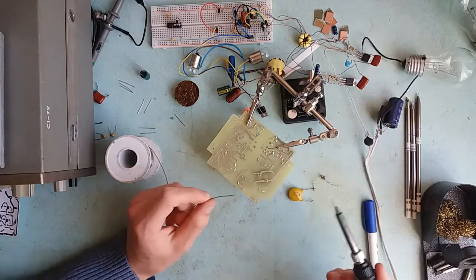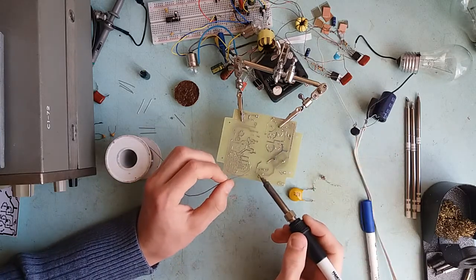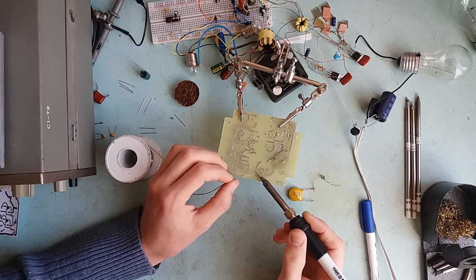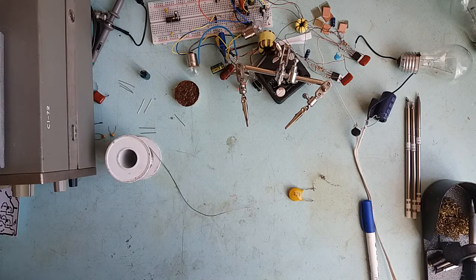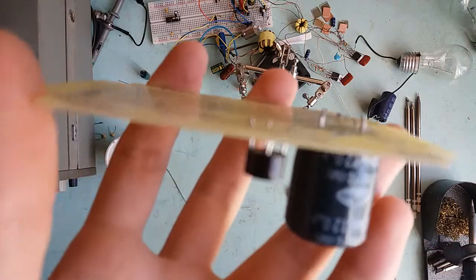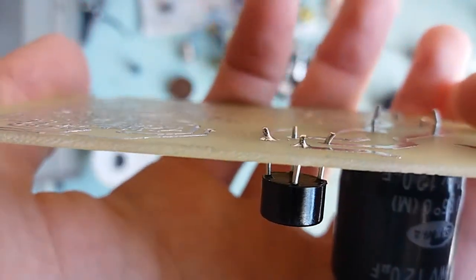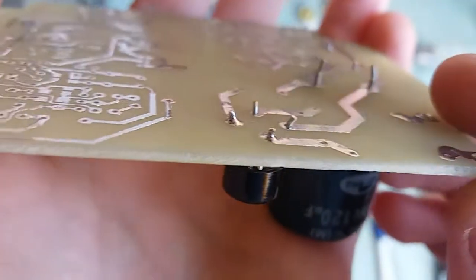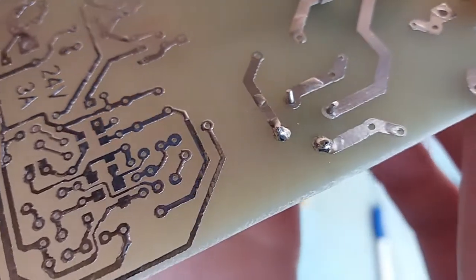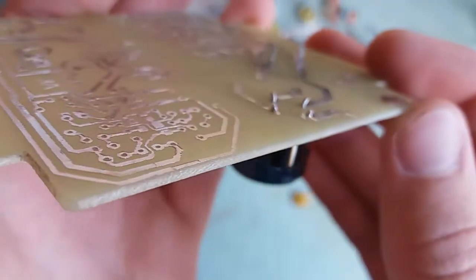Let's try a few more. Make sure it's oriented the nice way and still in shot. As you can see, it is a concave shape and has a bit more solder than the first one — that's the joint you want. The surface is nice and shiny. It's not a disturbed joint, it's not a cold joint. The amount of solder is just right.